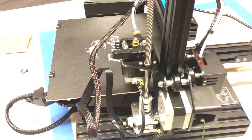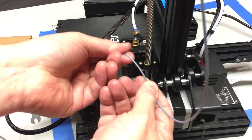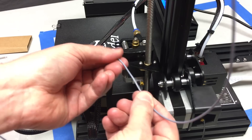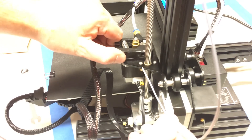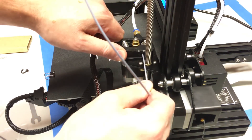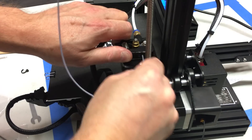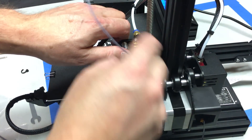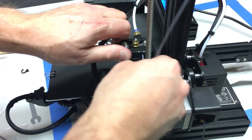With the Ender it's a manual feed system for the filament. Straighten it out — it doesn't have to be perfectly straight, but you don't want a lot of curl because that's going to make it harder to feed in. Once you've done that, squeeze the extruder to open and release tension on the idler, and feed the filament into the bowden tube. Keep shoving it in until you meet resistance.